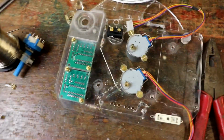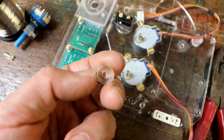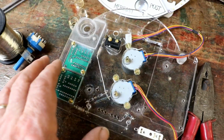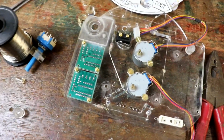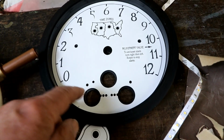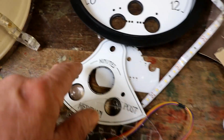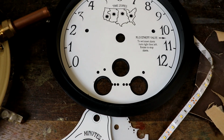I remember it was quite frustrating, and that's because I was using these spacers that I'd cut on the laser cutter, 12mm diameter with a 3.5mm hole through it, just as spacers, so that everything is spaced 10mm apart. That's 10mm behind that, that's 10mm in front of that. And I suddenly thought, having glued them all on in a fit of pique, why on earth not have these tapped? If they're tapped M3, it means that I can have, say, 10mm long brass screws holding this together onto that. It also means that this can then screw onto something else. I'm not quite sure about that, actually. I'll have a think.